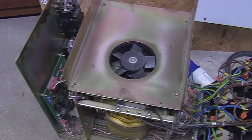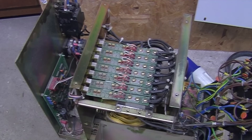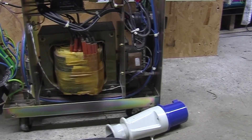Here's a top view. There's the fan that keeps the thyristors cool, and there are the thyristors themselves. Instead of using a mechanical tap changer, it uses these to simply select the correct winding from the transformer. Obviously it will do that with a zero crossing of the mains waveform, so it's a seamless step from one voltage to the next — no sudden spike in the supply. This is a view from the other side. You can see the incoming neutral supply going off to the right-hand side, and then all the feeds into the transformer coming from the thyristors, in at the different tap voltages at the top. And we've also got a small auxiliary transformer over there, which is for running the logic board and obviously the thyristors.